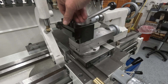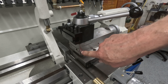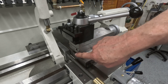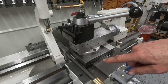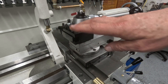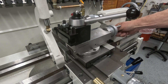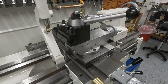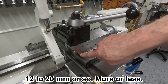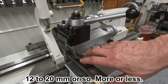Put a tool on here. I usually try and run the machine with the compound back flush against the edge of the way, which just makes sense for maximum rigidity. When I'm running the steady rest, that's usually a lighter cut job anyway. So all I've really got to do is move the compound over just a little bit to get full support of the steady rest — only about a half to three-quarters of an inch over the way. I think that's a nice modification.